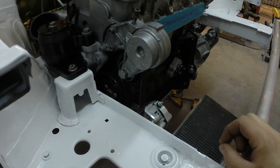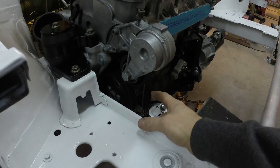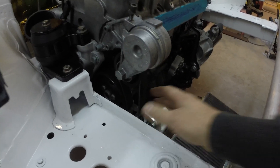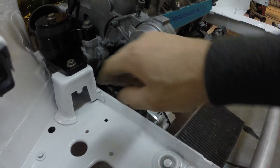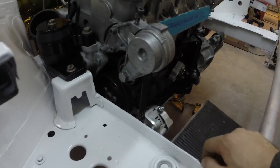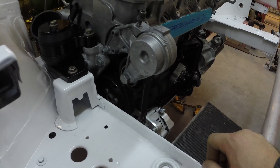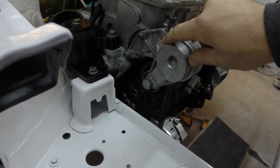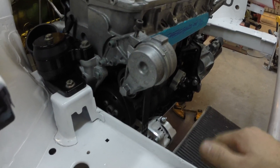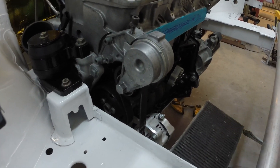Also, as mentioned in a previous video, I measured for the belt length with string. The first attempt was way too short - I couldn't even get it on all the pulleys with the adjuster all the way out. So I went back and got a longer one, which I thought was going to work out perfect. It turns out it's tight when the adjustment is all the way maxed out, so I think I'm going to go back and get one that's in between the two sizes and that should work out great.